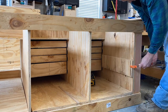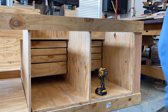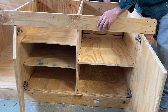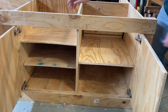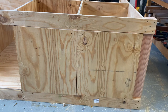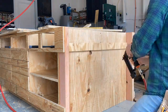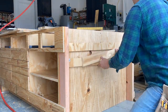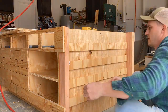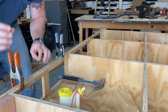You just make a simple jig like this to drill the required holes for all the shelf pins so you can have adjustable shelving on the inside. Then you just throw some doors on there and you can see the simple shelves I built on the inside. I attached four French cleats on either side. I'm just using some more scrap wood to add additional reinforcements across the top.